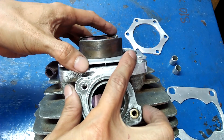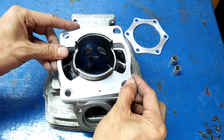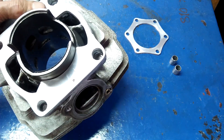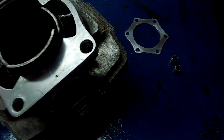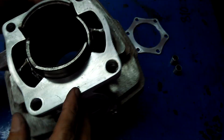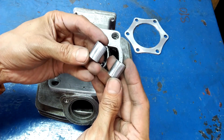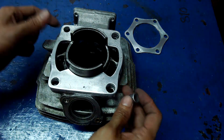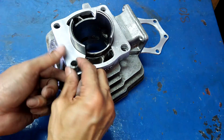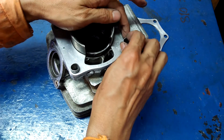To do that, I added this locating pin — it is just a piece of nail. I drilled a small hole of exact diameter and inserted the pin to keep these spacers perfectly aligned. I did that before the final grinding of the inside edges. I also have these custom-made dowel pins.